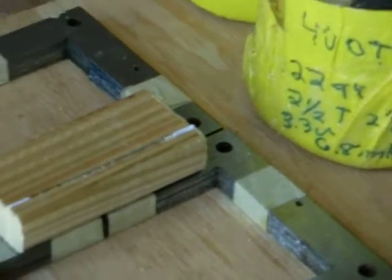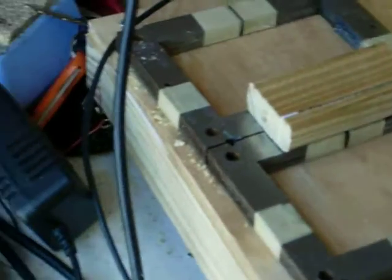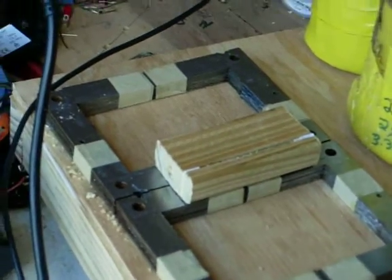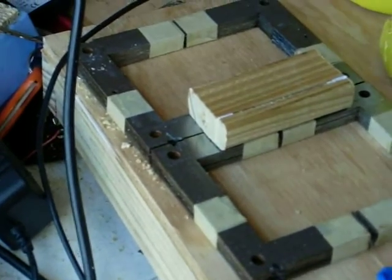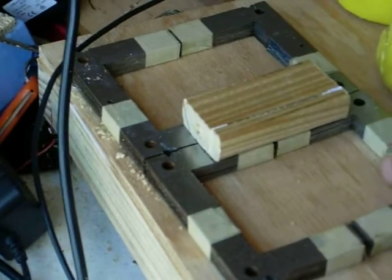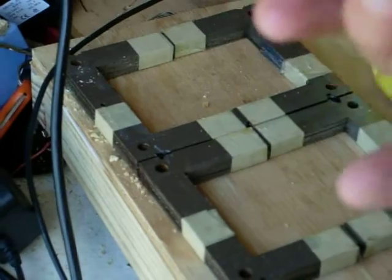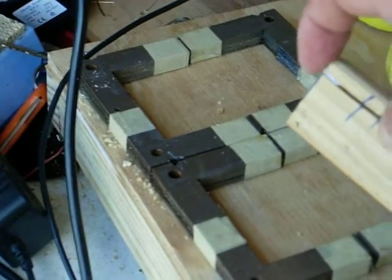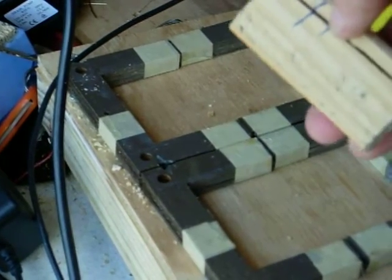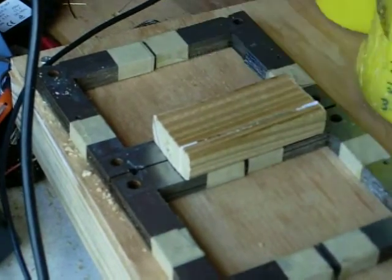I've got my cores done. Sorry about all the jumping around here, but I want to show you this — I'm trying to keep you step by step on what I'm doing. The cores are now varnished together in sections. This one has a hole in it for spinning the coil on it. I've also got some paper wadding in here with one end loose so I can extract the mold from the coil. It fits right over this area so the coil will sit out in this area.